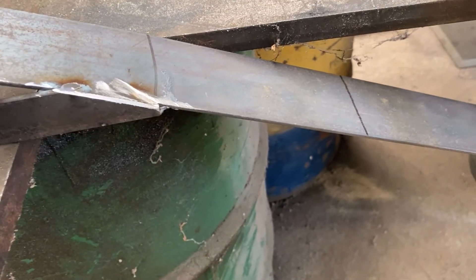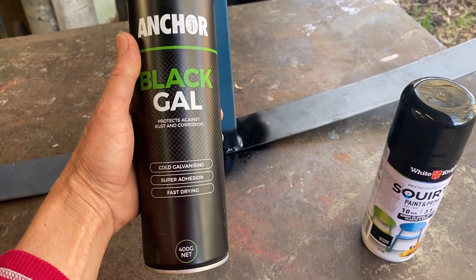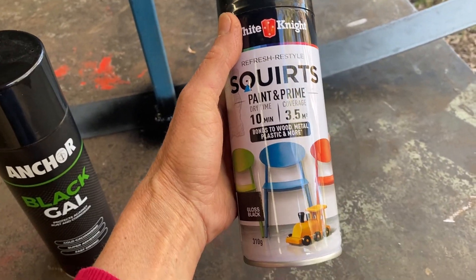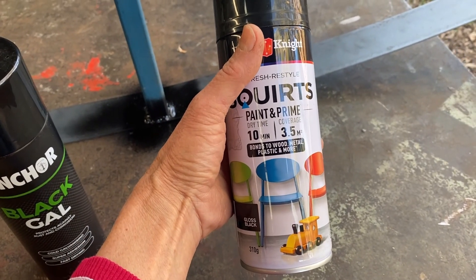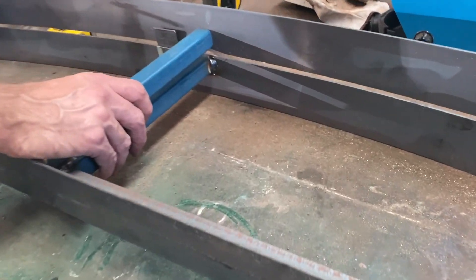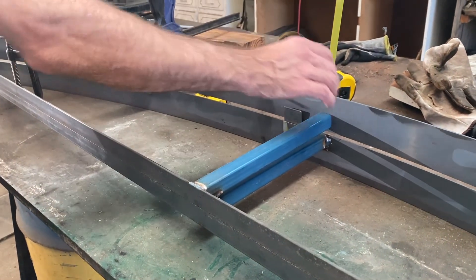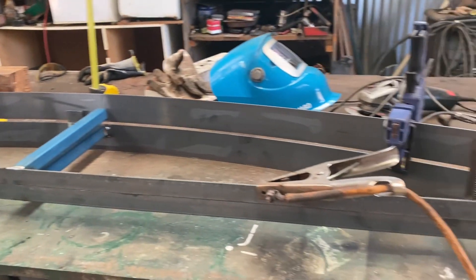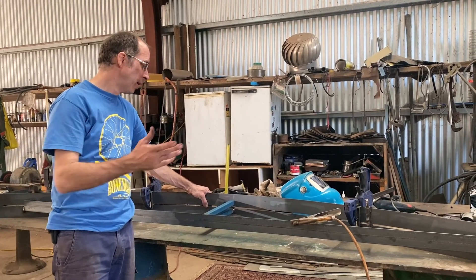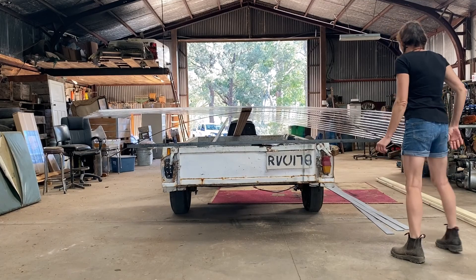John has just trimmed this edge a little to stick out so we've got a nice arch. I've sprayed all the welding points with cold gal — black gal in this case — to protect against corrosion, and I'll paint the rest of the metal with black spray paint to help prevent rust. I've got the first welded truss underneath and the second on top. I first welded a T-piece, then used clamps to hold the strap steel together, effectively using one as a pattern to manufacture the others so the curvature is perfectly even across all four trusses.